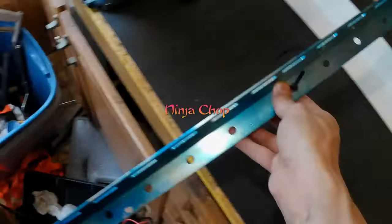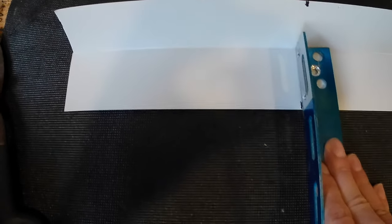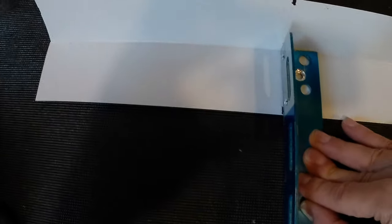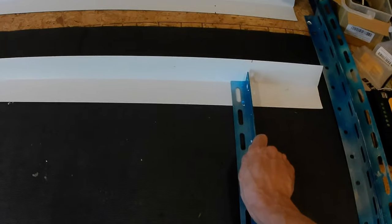The plan is to only put one rivet in for now, get it lined up and squared as best I can. The reason for only one rivet is so I can cut the right length of board to go across the bottom end to make sure it's squared, and I'll do that on both sides. Once two of those are made, I'll lay out the panels facing down, stand the frame up, and take advantage of the wall to stop it from flopping over while I attach a crossmember.